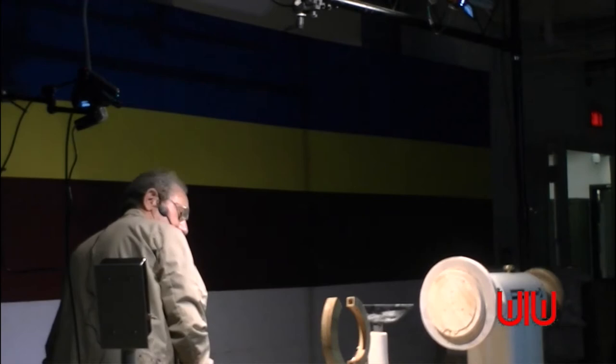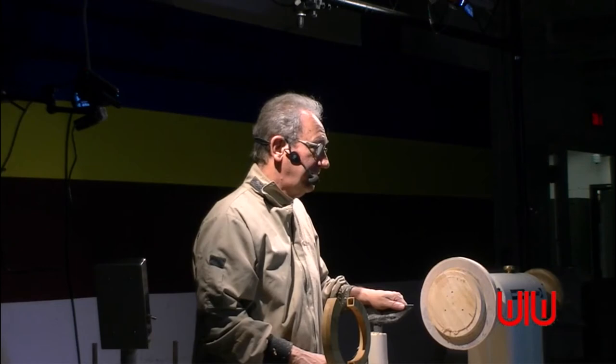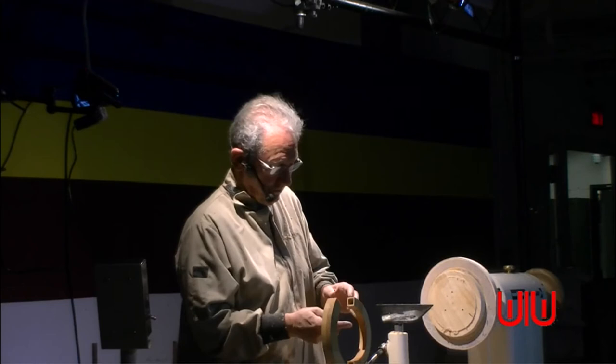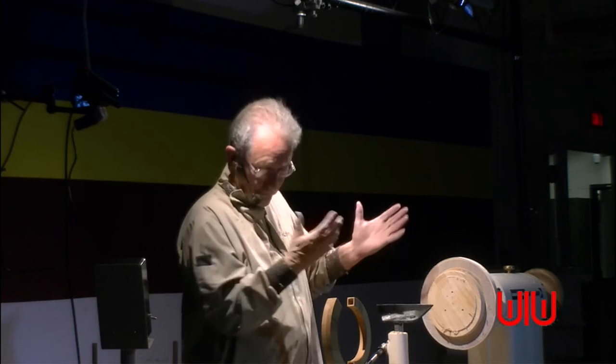In each ring, in between, what's the thickness of the tool you use? I'm sorry, the tool that I use? Because it's very, well, it's space. But don't you use a thin parting tool? No. You could, yeah, you could. I mean, like that, they'll be pretty much the same. If you use a thin parting tool, you're going to get your circles closer together. Yeah. Right? But they won't be perfect. Or you leave a dowel in between each one. You leave a space with a dowel.